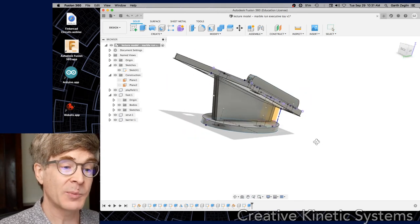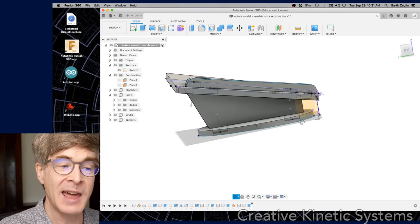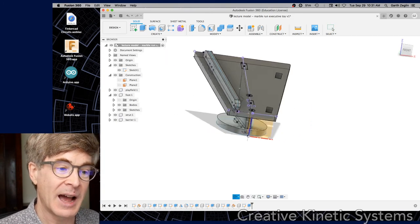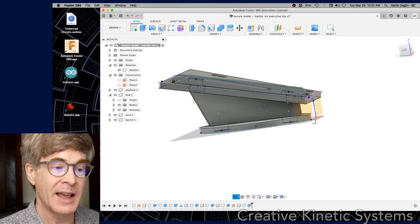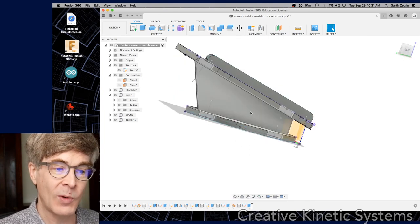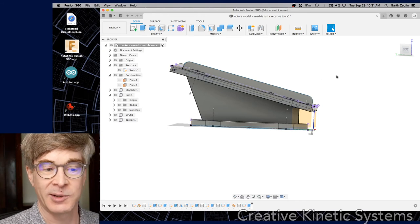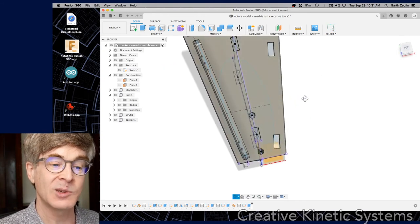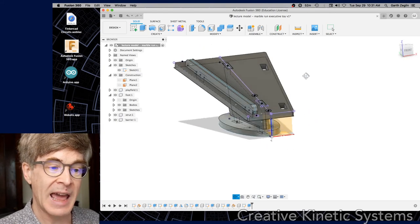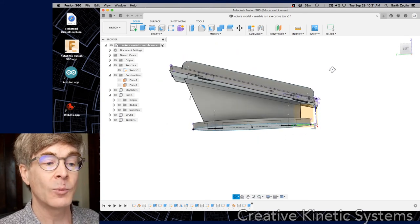Let's think now about that cross brace — we want to add one new feature which I just didn't think about. The lesson here is that in my original sketches I had a top view and a side view but not a lengthwise view. So I hadn't been visualizing the fact that I was going to have a fairly fragile T-structure where the top would wobble on a thin strut. We at least want to think about where we might add another part. The funny thing is, if we want the slots and tabs to fit in cleanly, the part we put in can't just go right across from this direction, because there's no plane along which the laser can cut a perpendicular slot at an angle — the slots come out perpendicular to the face, so we have to observe that as a constraint for how we place any bracing.